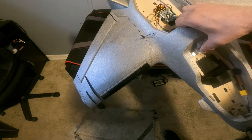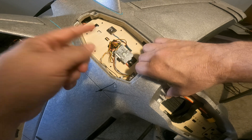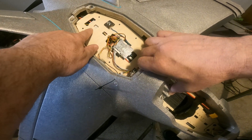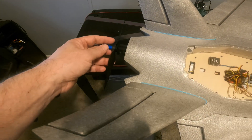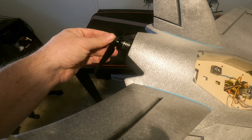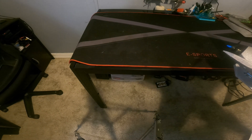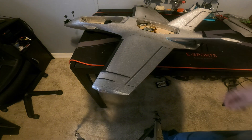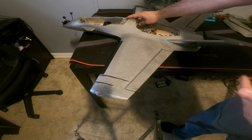For the antenna, I have it mounted on the side, stuck in a crack of the wing with a little hot glue to keep it from moving. I'll be making 3D printed parts for the F405 and GPS — probably a full plate for the inside. The motor I'm running is the MK2, which is a 20x22 1670 1300KV motor — I run it in my ZOHD and AR Pro and AR 900 planes, and I love it for the flight times and speed.